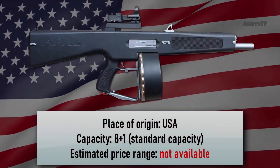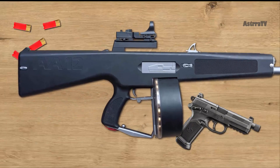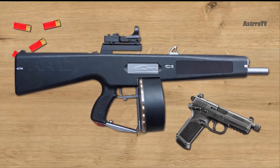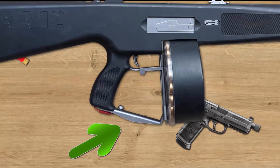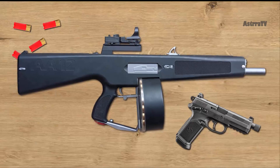Number 1 is the AA-12. The AA-12 fires from an open bolt, which is unusual for shotguns. To reduce peak recoil and cyclic rate of fire, Atchisson uses an extra-long recoil system, in which after each shot the bolt recoils much further back than is usually required to reload the weapon. It uses 8-round box, 20-round drum, or 32-round drum magazines. To provide the necessary support for heavy drum magazines during recoil, the gun is equipped with a magazine support bracket that rests against the pistol grip. Due to the abundant use of stainless steel and designed clearance for fouling, the weapon requires little cleaning or lubrication. Sadly, it's not available on the civilian market.